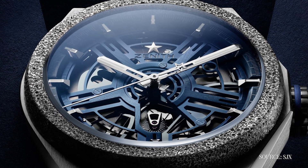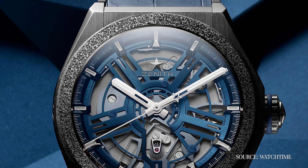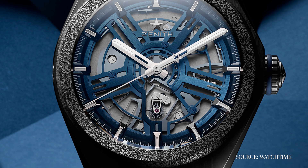It operated with incredibly low amplitude. Whereas a standard watch in good shape should run 300 degrees of amplitude, this system ran more like 16 to 20 degrees. Despite the high frequency, you could also get an admirable power reserve, and the initial claims were stunning — quartz-like accuracy, less than one-third of a second gained per day. They backed it up by bringing it to market as the Defy Inventor in 2019, and almost immediately there were issues. The watch was claimed as a chronometer, but none of them were running to chronometer spec. The watch went back, changes were made, it still wasn't running as advertised in many cases. Zenith first stopped advertising it as a chronometer, then simply stopped making it — at least one major reversal for a brand that had all the resources in the world.